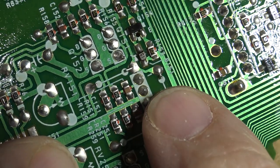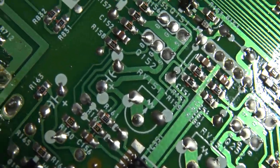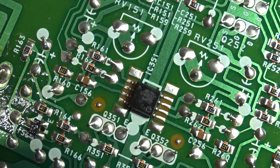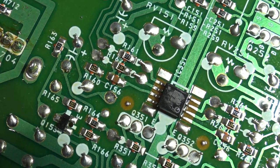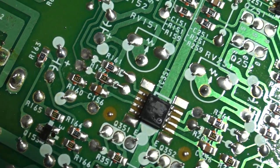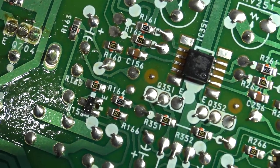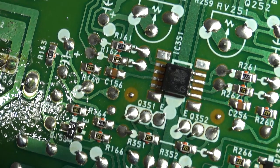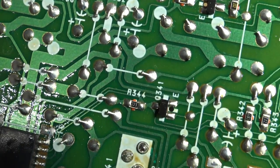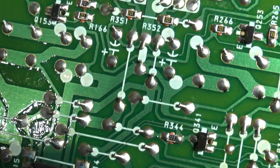This is the playback head connector right here. I know it definitely was picking up noise from my little CRT that I just displayed the time on, because the noise level dropped when I turned that off. That's just a little 4-inch black and white CRT. So the noise is getting into this thing externally, because when I unplugged the head, the noise level dropped big time. So I wonder, it could even be the head wire. I didn't look at that, but we'll take a look at that.